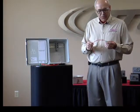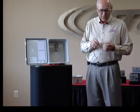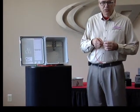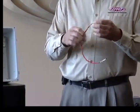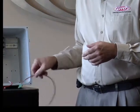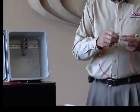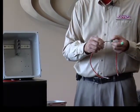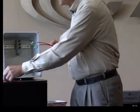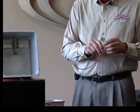Certainly, we offer a terminal block that is a detented pinch clamp design. You can simply slide these into a detent and it will pinch the wires in there quite safely. We would have that available for all of these modules. We also have a terminal block that is a screw connection. So you can go in there and clamp down on the screw connection. And last but not least, we'd have what we would term our continuous output block.